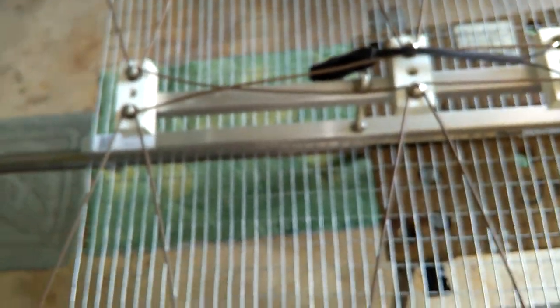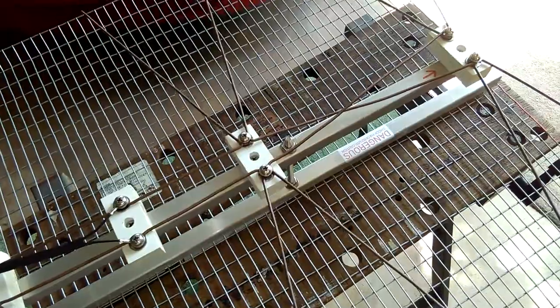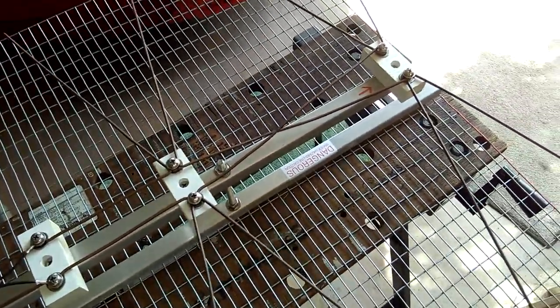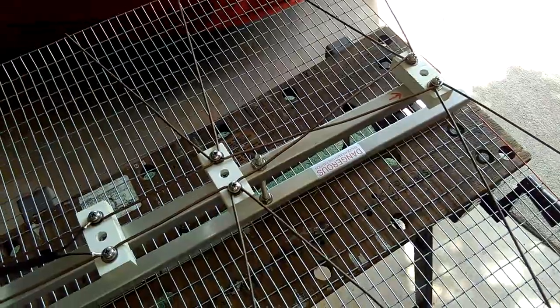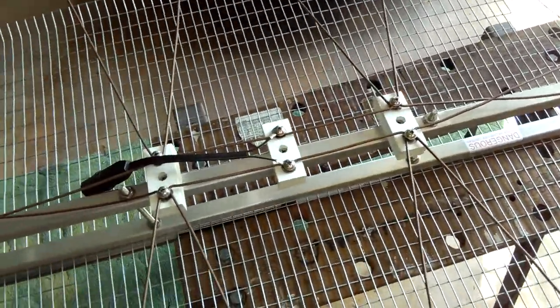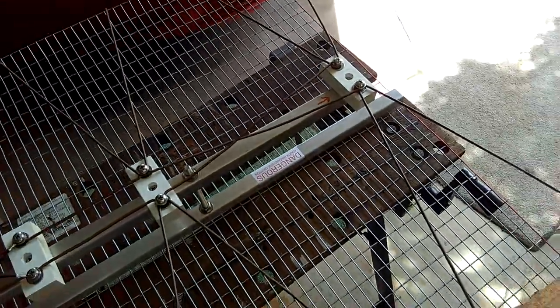The reflector is 36 by 29 inches for this antenna. That's nine inches between the bays and nine and a half inch whiskers.